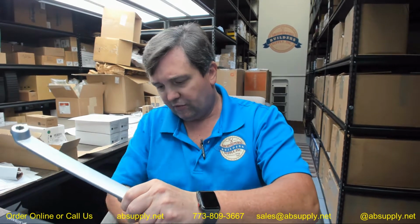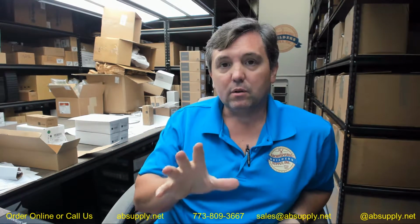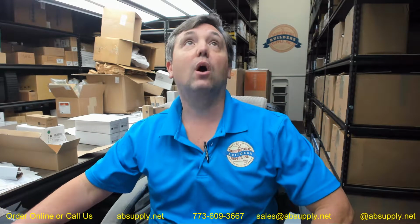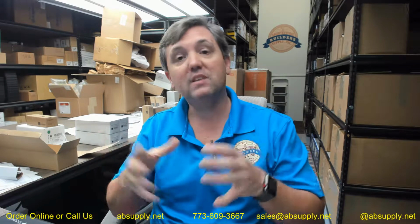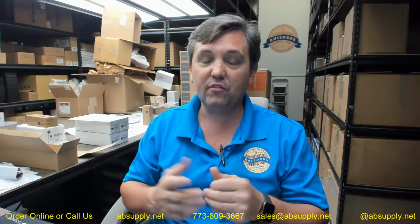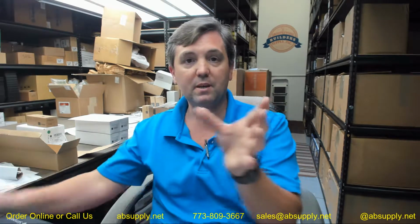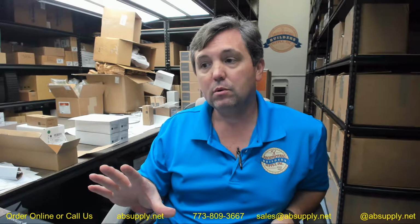One thing I'd like to mention is it's very common that we sell these arms alone, not with a door closer. But be mindful first, before proceeding with the order, assuming that you already have a door closer installed, that you're probably going to need to review what you want to accomplish based on what you've already done. Here's what I mean. If you want the door to go to 180 or 150 degrees, and you've looked at the installation instructions, you may or may not have a problem with where you have already currently installed the door closer body, because the physical positioning of the door closer body on the door is directly related to that degree.